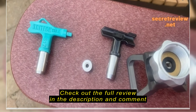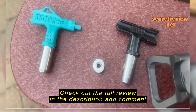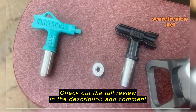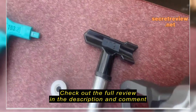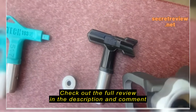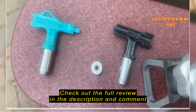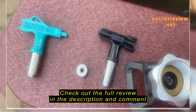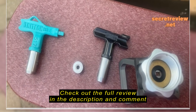That's a nice feature that this Shuuito tip does not have — you can push it in, and it's pointed to help, but it doesn't fit right in there. That's probably no big deal. These tip seals do wear out depending on what product you're spraying, especially something with a lot of solids. Under high pressure they wear out and you have to change them, so it's nice that each tip comes with one.